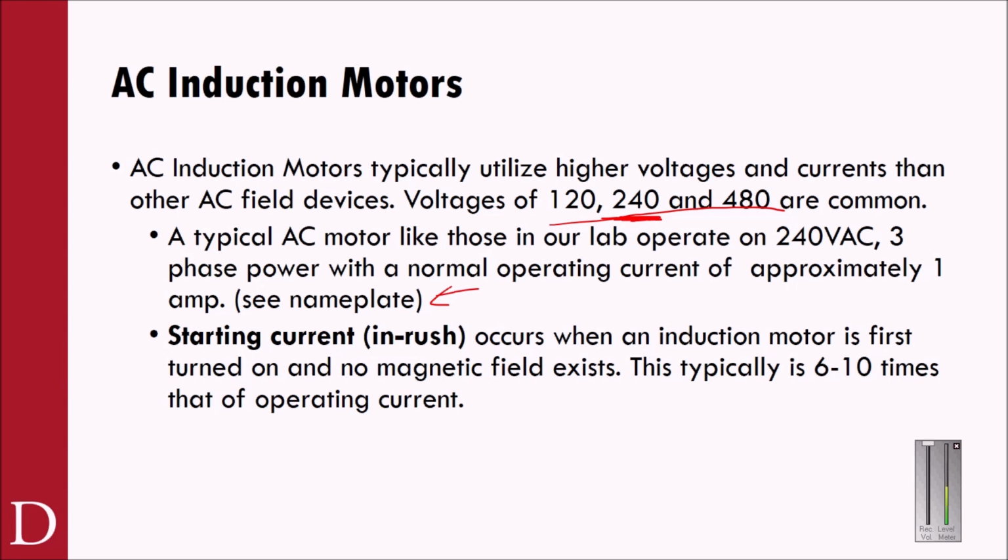In some cases you may even have to take a cover plate off to look at that. Before you do any of that stuff though, I can't say enough as far as safety is concerned when dealing with 240 volts AC. Make sure as you're doing all your wiring that you are locked out and tagged out. I even recommend grabbing a meter and just testing for voltages to make sure there's nothing that could cause us any trouble.